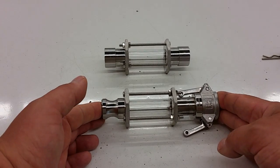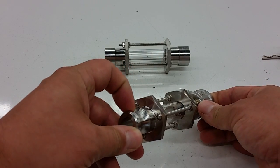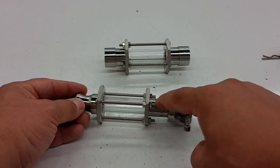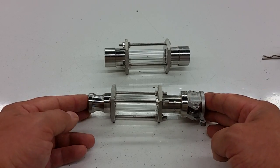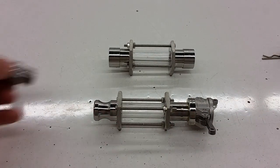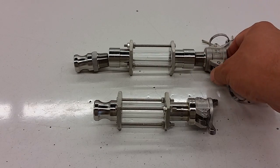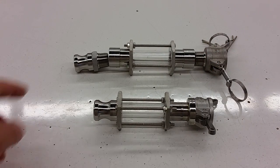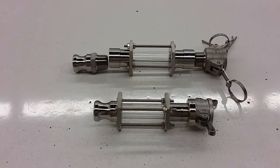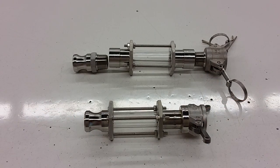This one here has integrated cam lock — this end block actually has a male cam machined into it, and this side has a female cam lock TIG welded on, so it's much more compact. If you were to try to build this version using the MPT model, you'd have to thread in an F and a B cam lock, which would make it a lot more bulky and give you more places for crud to get trapped. So this particular unit is a lot better if you're already invested in the cam lock system.